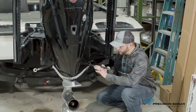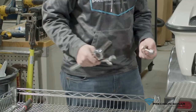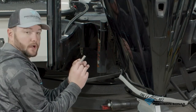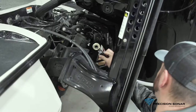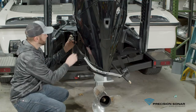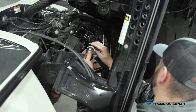Now that we've got our tethers on the motor, we'll get our stainless steel hardware and our 15/16 wrench and socket and install the tethers onto the brackets. We'll take our stainless steel hardware, overlay the washer onto the bolt, take our main tether and place it up to the top hole — because this is a Mercury four-stroke, everything is a little bit tighter due to the skirt area. Going to the top hole gives us the most amount of slack. We'll put the bolt through the bracket and put the nut on it.